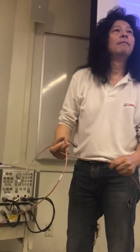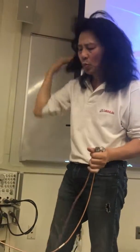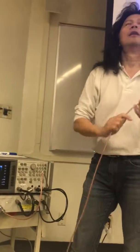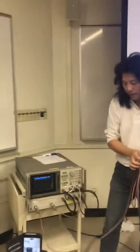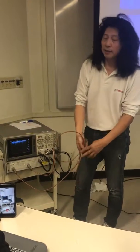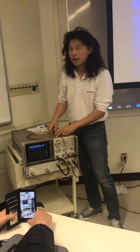What type of connectors are those? N-type. Yeah, it's called N connector. N connector is popular for lower frequencies and in the oldest communication systems, because they can handle more power, but it's bulky, it's bigger. So the new standard is the smaller SMA, or even smaller, called SSMA, small SMA. But there are many, many types.